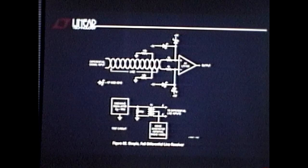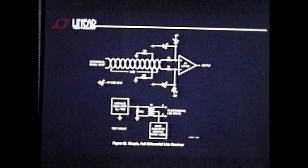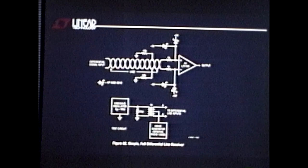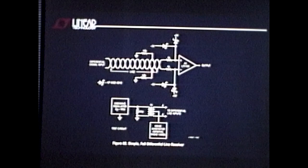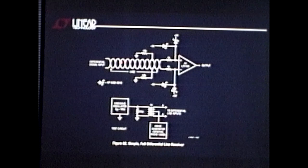This is also an example of a differential amplifier at high speed, one that's quite commonly required — line receiving. I always draw a twisted pair line like that. Conceptually it's very simple: you're driving a differential signal down a twisted pair and receiving it with a wideband differential amplifier. All this additional circuitry addresses real-world concerns: you've got to provide protection for ESD events, and all this current limiting and clamping does that. These resistors provide a DC path for the input bias current, and these resistors provide current limiting into the Schottky clamp so you can't overdrive the inputs for static events on the line.